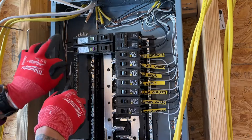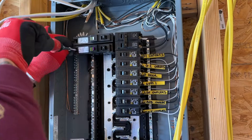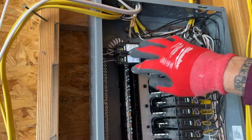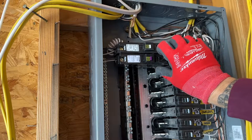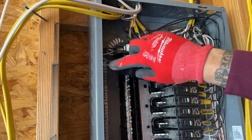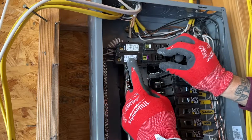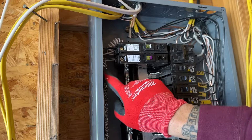Landing the hot wire is a little bit easier — we have a little bit more room to work with. And that's it. You can see I have my hot, my neutral, hot and neutral. The pigtail does take up some more room. We have our hot and our neutral going to the back of the breaker. This top one has the pigtail so you can see that it does take up a little bit more room. But if I want to pop these off, just pull it out — this is essentially how it's wired in the back. I like cutting the wires first, then pulling this off and securing them because then you can hold on to this, you're not torquing it while you're trying to screw it down. You can hold on to it, screw it down, and make sure that all the wires are seated properly. Then we can come in here, pop it on the neutral bar, pop it on our load, and we're grabbed onto the neutral like the pigtail. And we have our hot and our neutral in the back of the breaker.